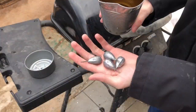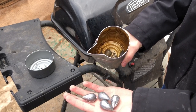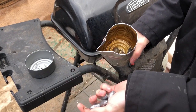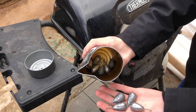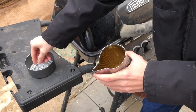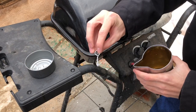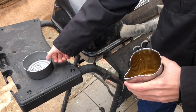As you can see here, this is what we're going to be melting down today. Pretty much just these old bank sinkers, teardrop style sinker, old homemade ones. We're going to melt those down along with some old birdshot, and then for our eyes we just twisted up some old bailing wire. We're going to put that down in the mold and cast them up.